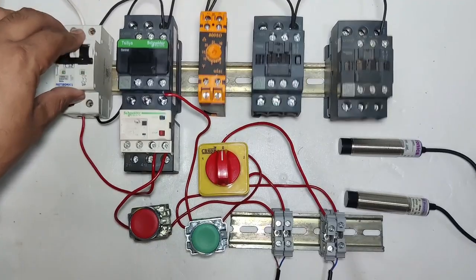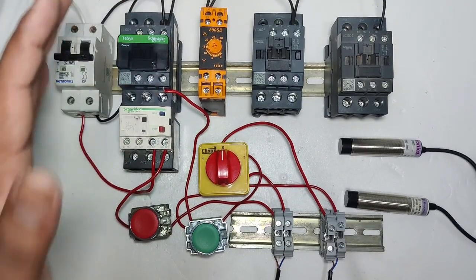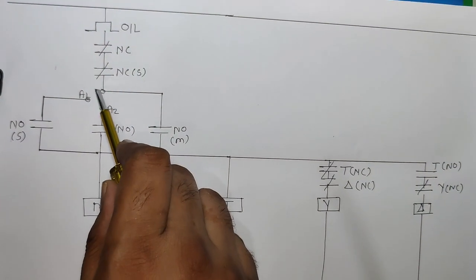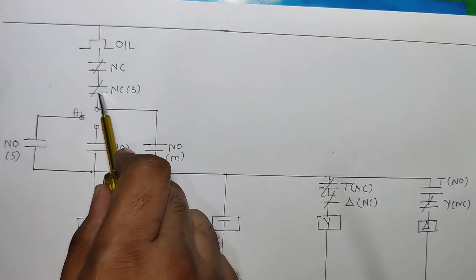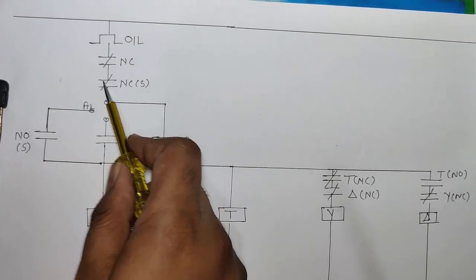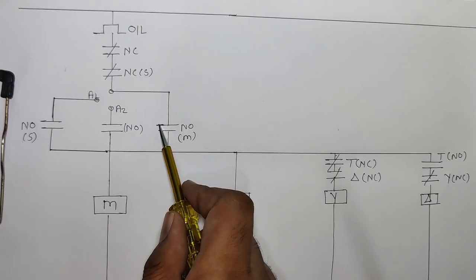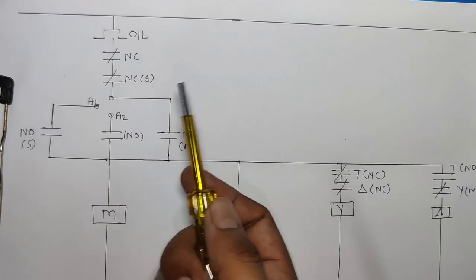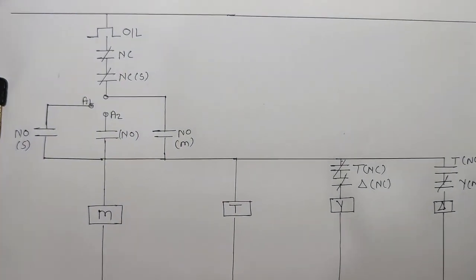Okay, and for holding connection, how to do proper holding? Okay, so first understand in drawing, after that we will do holding connection. So where we need to take holding wire. So for holding wire you can take from selector switch common, from NC output terminal, and connect one connector from common and connect to the contactor ANO terminal. Okay, just we do simple holding connection.